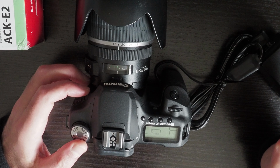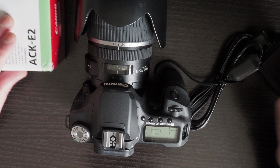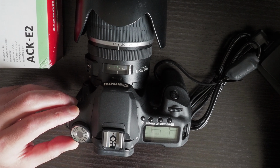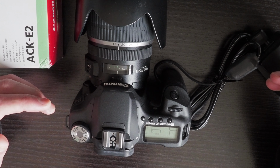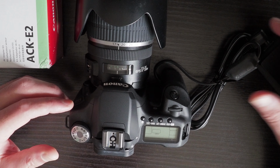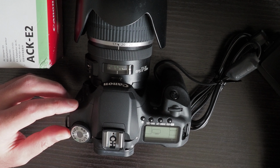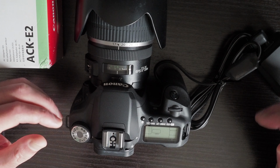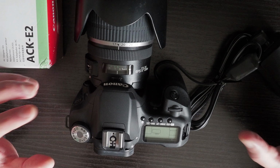The one thing I would say is I don't actually recommend that you buy the official Canon dummy battery and AC adapter, partially because it's expensive relative to third-party ones, but also you have this unique connection port, which is probably not the best one because you won't be able to use the adapter or dummy battery with any other cameras. So for example, if you have a generic third-party adapter that takes a generic connection, like those barrel connections with 5.5 millimeters external ring and then the internal one with, I think it's 2.5 or 2.1, then those are more generic and you'd be able to use the adapter with any dummy battery as long as the voltage and the current it supplies match. Whereas with the Canon one, you need to have the specific connection, which is just based on the Canon's version of doing things. So because of that, I wouldn't recommend buying the official one.